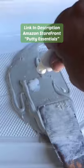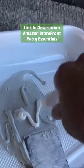I'm gonna use some Bondo — you guys already knew that. What I want to do here is use enough cream hardener to where it's going to set enough for me to sand in 10-15 minutes. First I apply it with my little putty knife, and then I make sure I use my six-inch so that everything's nice and flat and smooth. Do the same thing to the stringers, right — the cracks on the stringers. Once it's dry, make sure you sand the edges.